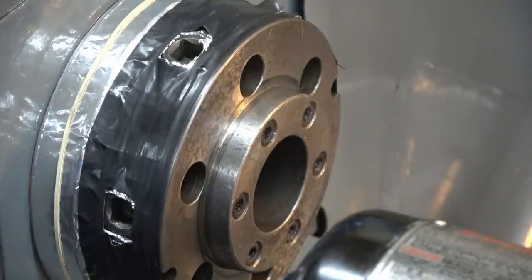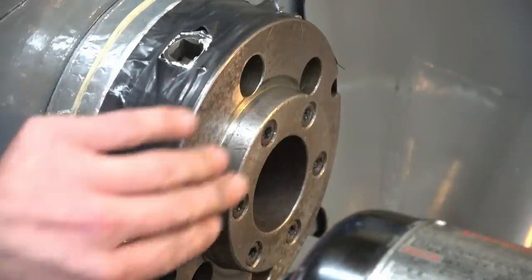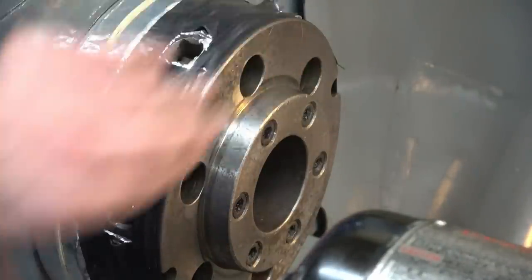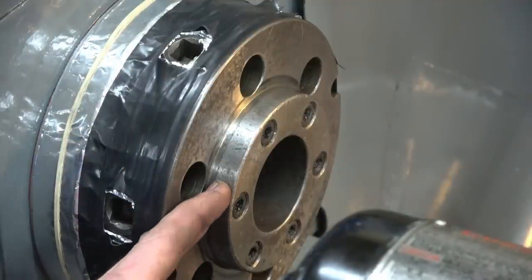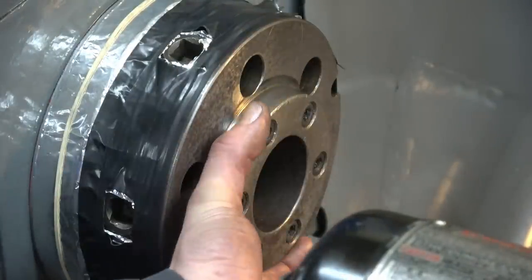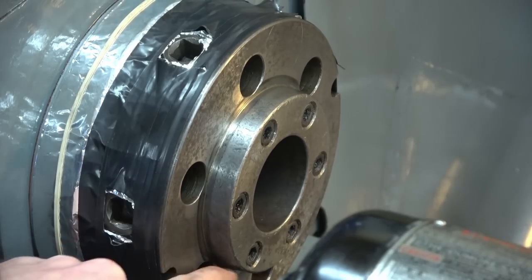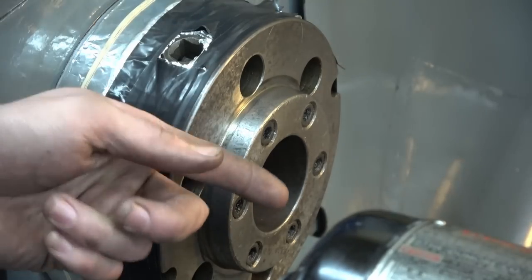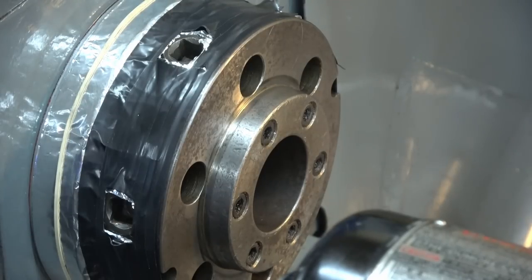Compare that to, say, a Morse taper where it's just on the tapered portion — this requires the taper and the face, so both surfaces have to be right. I'm going to start with the taper and just grind it until I regain what I consider to be a satisfactory surface. There'll still be some evidence of these dings, but I'm going to remove the high spots and regain, hopefully, 85% of the surface.